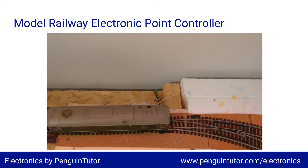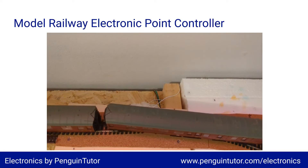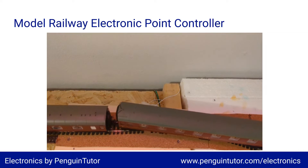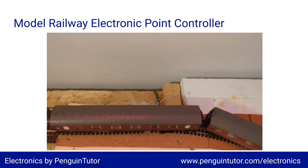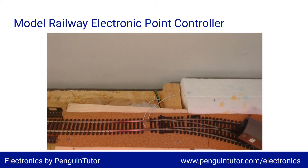The reason I'm wanting to expand the number of GPIO pins is for my electronic point controller project. In particular, I'm looking at creating a panel with LEDs and switches to control the points on the model railway. There are four points which can each be moved into two different positions, which needs eight LEDs and eight switch inputs — using 16 of the 26 pins of the Pico.